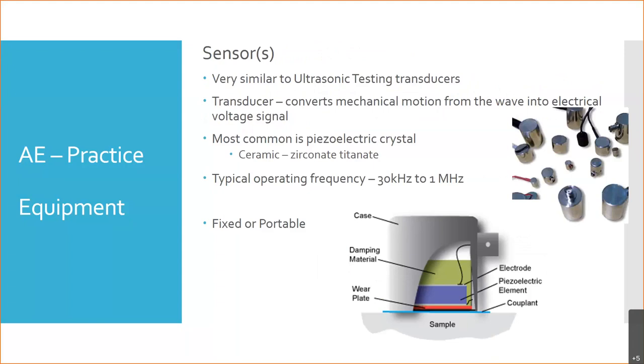with an operating frequency, are going to provide a certain amount of filtering. If you have a sensor that operates in, say, the 30 to 300 kilohertz range, it's not going to pick up the stuff below that. It's not even going to pick up stuff above that. But the signal we want may end up in the 40 to 45 kilohertz range, right? So now we're picking up 30 to 100, for example, and we're interested in 40 to 45. Now we've got to get rid of that 30 to 40 and that 45 to 100.